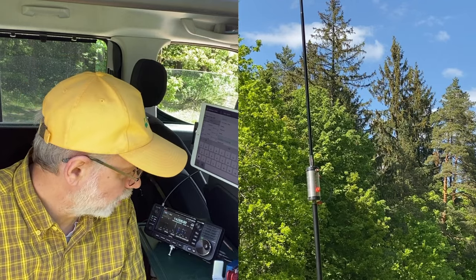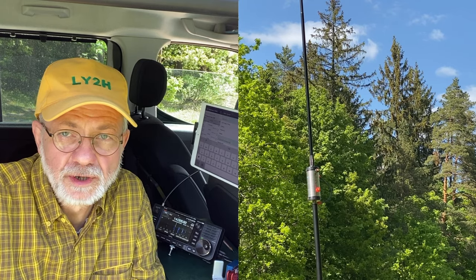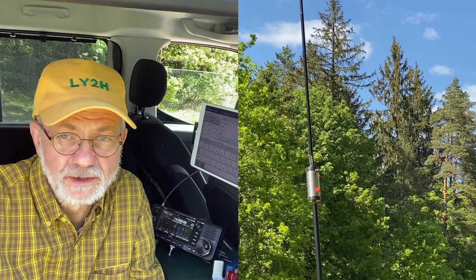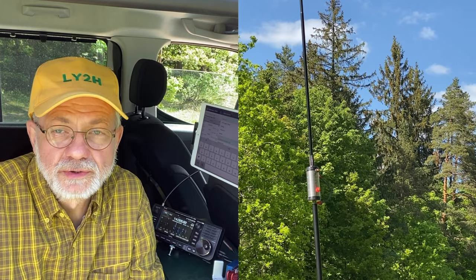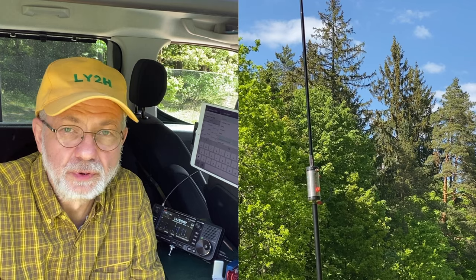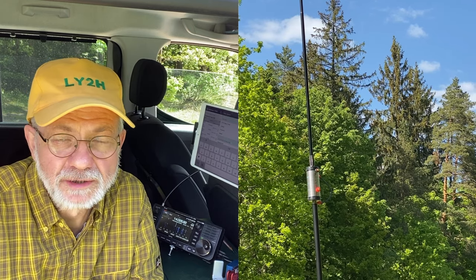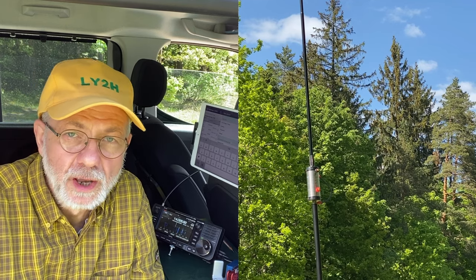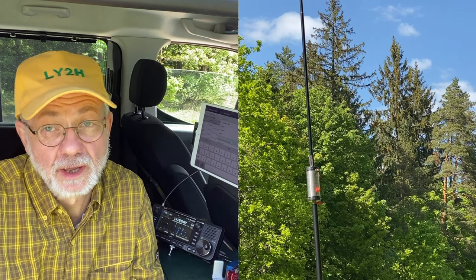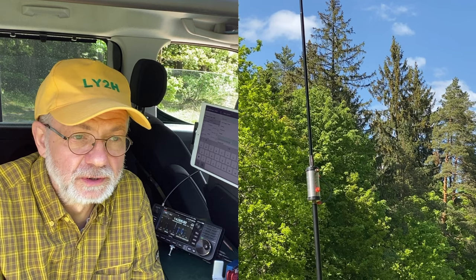So these two guys can work together, except probably in situations where you need speed and a very quick rate of work. I mean, if you are in a contest outdoors, or if you are activating a park, as I often do, then you need to be very quick and easily deployable, spending as little time as possible switching bands, tuning and retuning everything. That's out of the question. So the best way is to have an antenna which works on all bands, or to use an antenna tuner with your multiband antenna, or to have a resonant antenna, pre-tuned and easily working on all bands, like an end-fed half-wave, transformer-fed antenna.